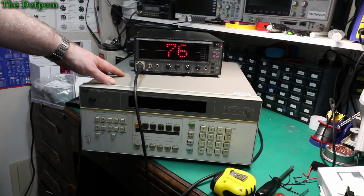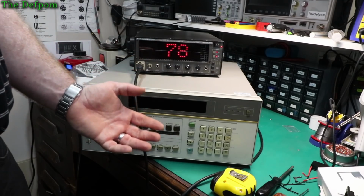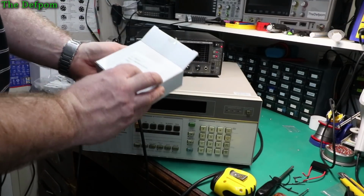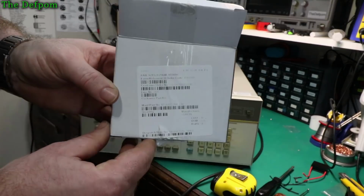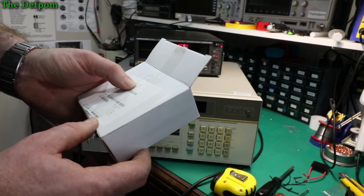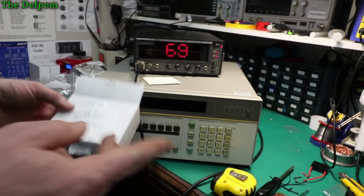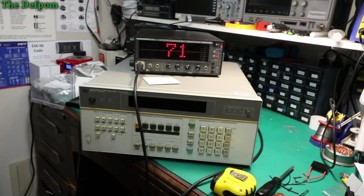You can put up with that sound level now because it's really quiet. So these little fans, although they're fairly cheap, have a very low noise level. So that's the part number on them, 1568508 from Farnell. And there's a little sticker on the back if I can show you that. Hope it will focus on it. So it's 92 by 92 by 25mm, 115 volt AC, and it's a Sunon fan. And I've got 2 more of those. That's good because that's a nice quiet fan. I actually quite like that. That's good. Job done.